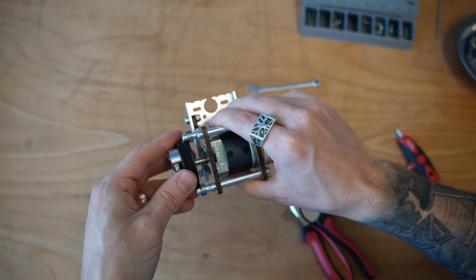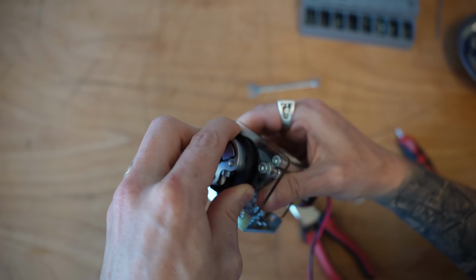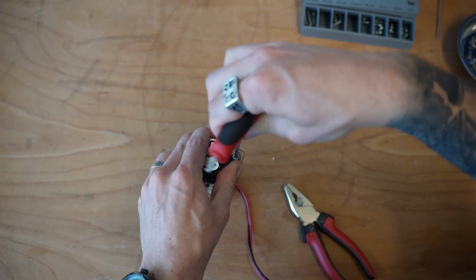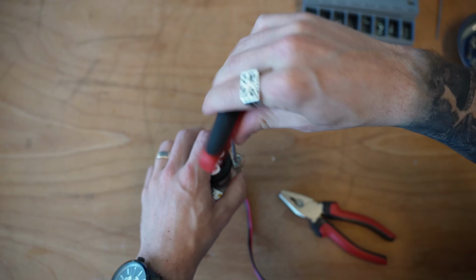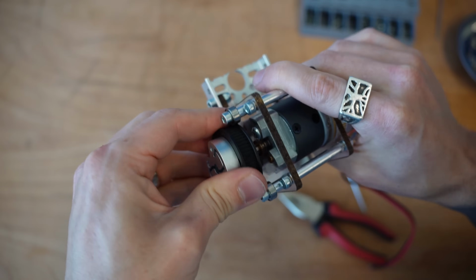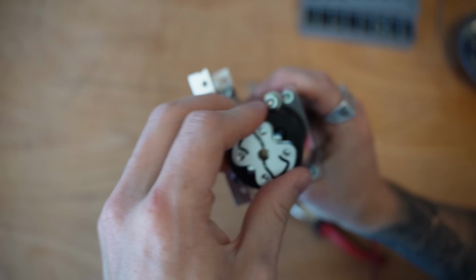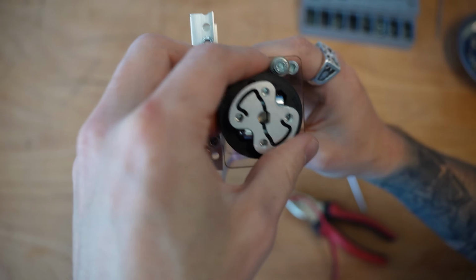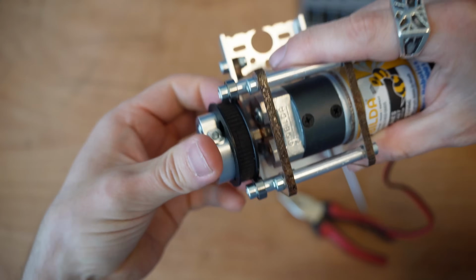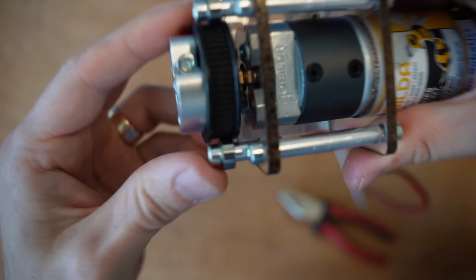On this one, we're going to mount this against our unit with the pulley facing into our ball bearings. We might need to loosen these off a little bit so that we can get a little bit of play on this here. I find this is easier to get the 8mm hex on. There we go. If you're using a D shaft, you hopefully get it on there. And I find that if I kind of torque this, get it in on an angle, and then push it in, you can get just enough to be able to slide that in like so.